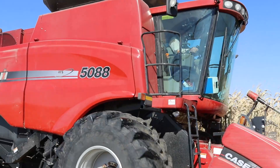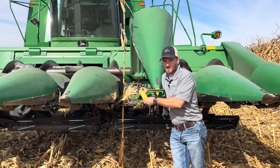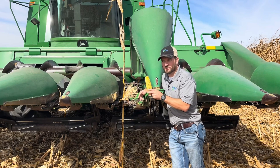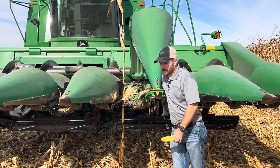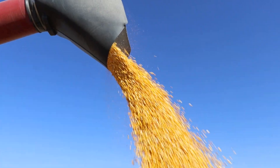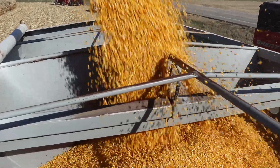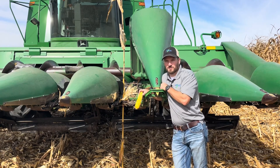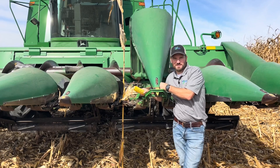This fall, if it's butt shelling, there are adjustments you can make. If it's that dry, you're going to end up having some butt shelling — try to get to the drier fields first, get those harvested, and reduce as much of that as you can by adjusting those deck plates. If you're seeing whole ears on the ground, that's not a good thing. There could be ear droppage before the combine gets to the field, but if you're seeing whole ears thrown out of the head, you need to pay attention to how it's happening. Hopefully this gives you a few tips for this fall and things to think about for next year — whether it's management or equipment — to lose a little less at harvest. Thanks for watching, and stay in the know with Liquid Grow.